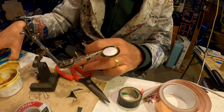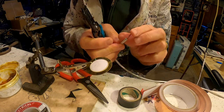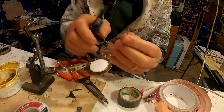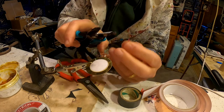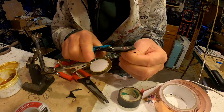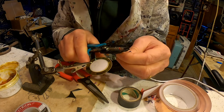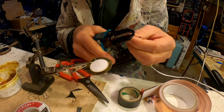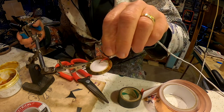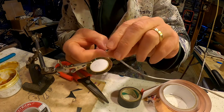Okay, now I'm getting my finer wire stripping tool, and I'm going back to where the little dot by the 26 gauge. You might have to figure out your own gauge, and stripping like a quarter inch of it. You just get a little bit of copper. I want it to sit right there on top of that piezo.